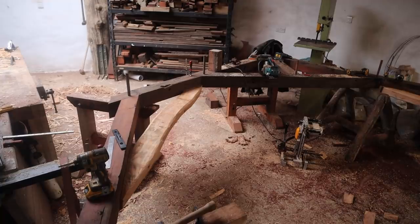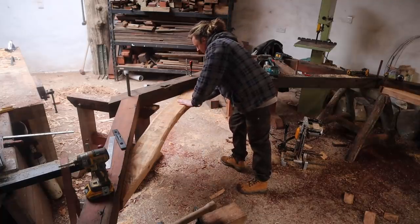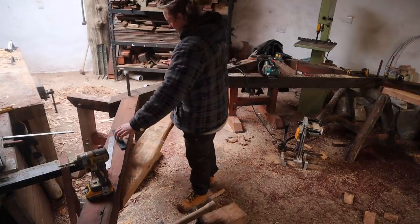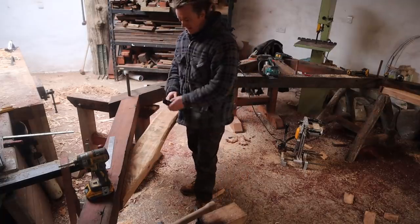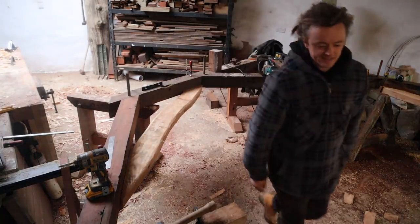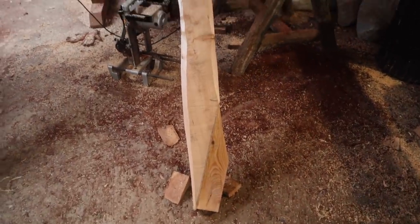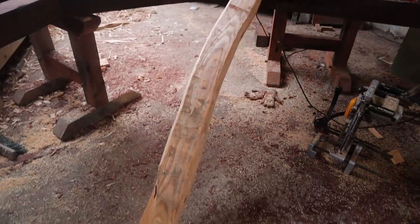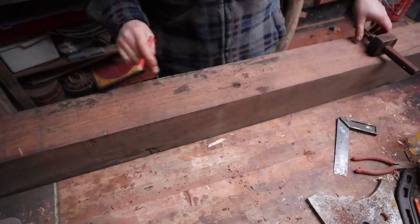It's the next morning — I never got around to mortising yesterday, so many jobs going on. We're back on it. I've marked the tenons on the underside of these beams, so when we take this apart and flip it over I can transfer those marks to the face and cut out the mortises. While I've got to take it apart anyway, I'm going to cut every other mortise I need to do — three mortises through here, on the other side, and one for the wind bracing. That means this is the last time I have to take it apart. Here's a quick view of the two finished braces — they look complicated but it's really not difficult at all.